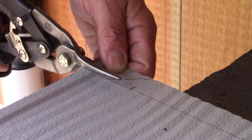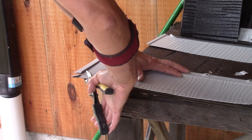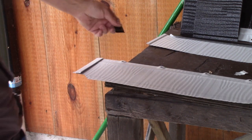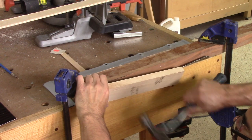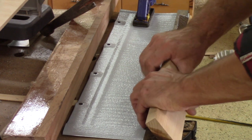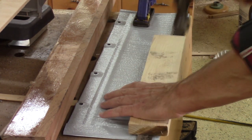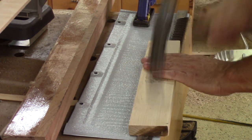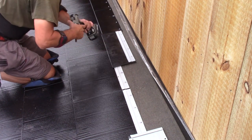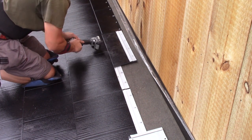If only it was just that — I'm missing two tiles. I don't want to buy a full 28-tile box for only two tiles, not counting the month and a half of waiting for delivery. So I'll use one of my cutoffs to make the missing tiles. After the first fold at ninety degrees, I use a metal ruler to keep a gap for the second fold. My new tiles are a bit harder to install, but it's almost unnoticeable that those are not from the factory.